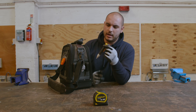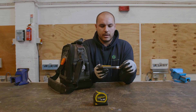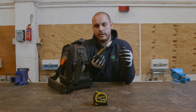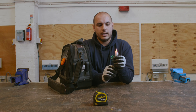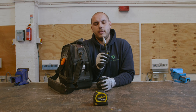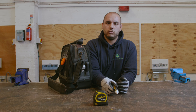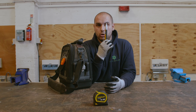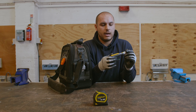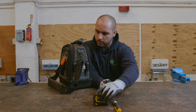The next thing I have here is this one — it's a Fluke. You can get them in different makes and models, but basically this is a Fluke Volt Alert pen. This lights up and shows where there may be voltage on wires and that kind of stuff. It's good because it's non-contact — you can just go across something and it will light up and give you an indication that there may be voltage there. So that's another cool thing to have. That's a Fluke Volt Alert pen — so that's two parts there.